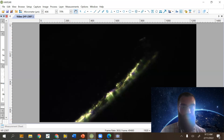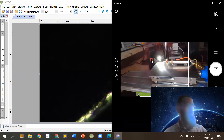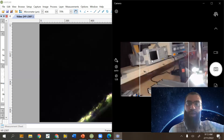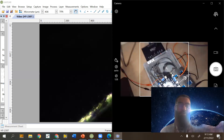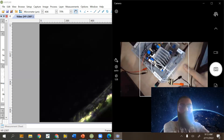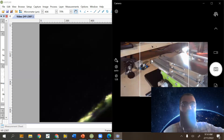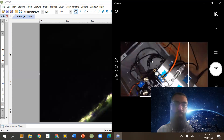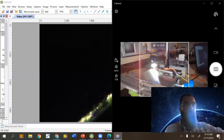Now I want to show you the stroke measurement and how I set everything up so you can replicate it. I have this function generator, the amp, the bipolar power supply - I've mentioned these in previous videos. I have my oscilloscope, my amplifier, my transformer, and the output. I've added resettable polymer fuses - I think they're one amp - to limit the current, because the amplifier sometimes gets unstable, which means it burns out and draws too much current.